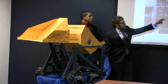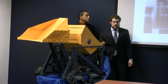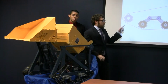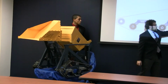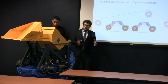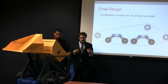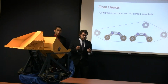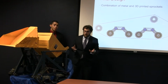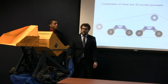And here we have the 2 motor inputs, the sprocket output, and the internal gearbox configuration. And here we have the overall system and how it works. We have this sprocket over here, that's our driving sprocket. This means we don't have the issue of last year's robot, which had 2 driving sprockets with 2 individual motors. The issue is that if one motor spins at an RPM slightly larger than the other, after a certain amount of time it will slip, and you'll have failure on the field, which is not good.